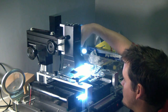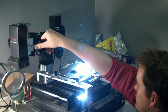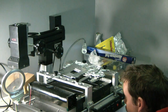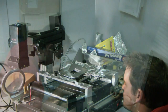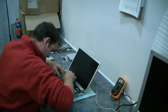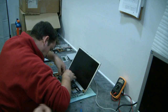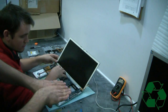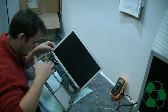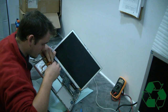We just turned on the cooling on the infrared station here. We'll let the board cool off, and once that's done we'll bring it over and test her out. Trey tried to pull out the bow that was on the side — the right-hand side where all the auxiliary connections go in was tipped down. So he heated it up with the heat gun and just took the bow out of that board. So it's nice and straight, we got the chips reflowed, now it's time to test it.